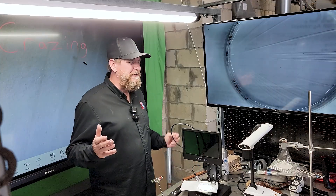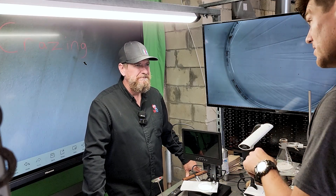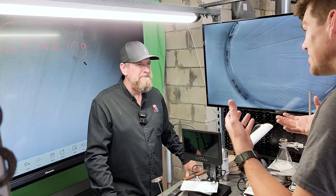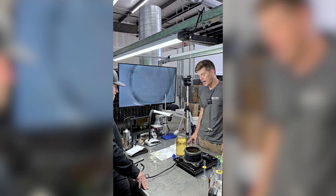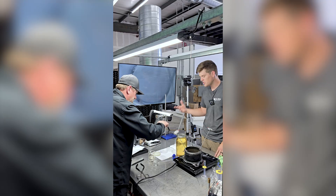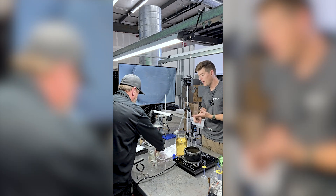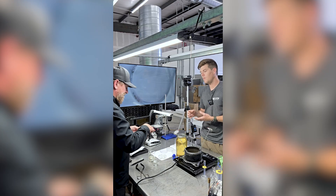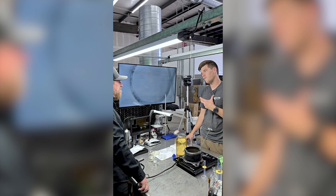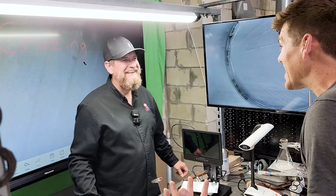I wouldn't have put those pieces together. We've learned today that you don't really know what you're going to find until you start testing things and asking questions. I can go back to probably a million situations where I've spilled oil, saturated things with oil changing evaporator coils without doing any cleaning — thinking I was protecting the coil. But what about fan shrouds or fan blades that are plastic? What about those things saturated in this oil in the air stream? We think, 'these guys are making really cheap plastic,' when really we've been rubbing oil that eats plastic on everything.